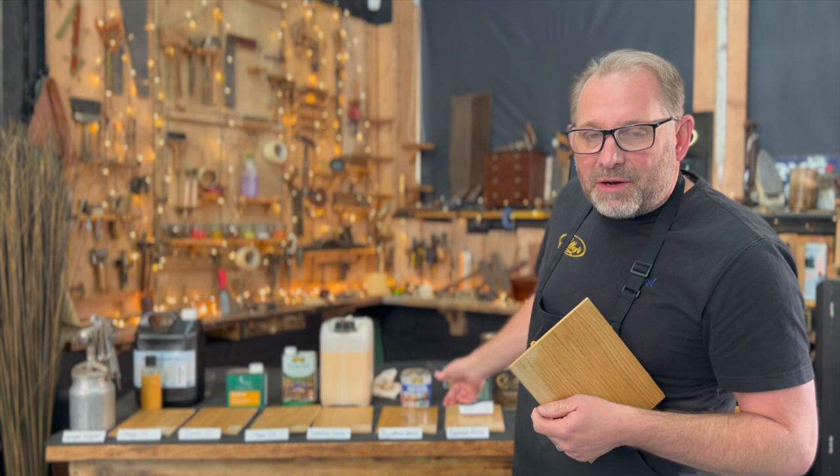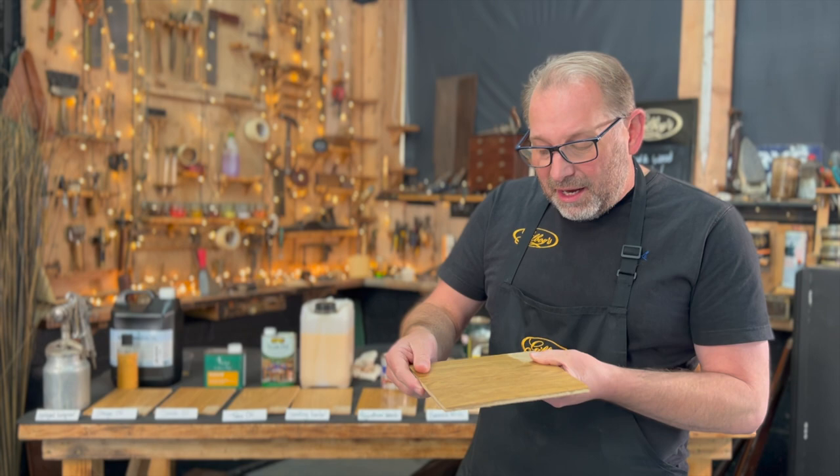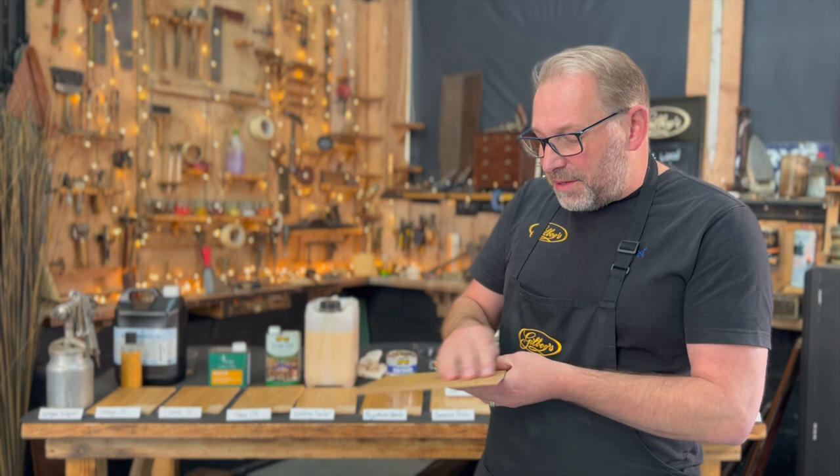I've just written an article about using hard wax oil on antiques — I mean antiques that have dropped in value, not really expensive ones. Instead of using sanding sealers, polyurethanes, or wipe-on polys, why not use a hard wax oil? It makes perfect sense. You can just wax over the top of this. I'm going to wax this sample now with a bit of our Antique Gold so you can see what it looks like — a really practical, serviceable piece of furniture that also looks great.